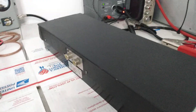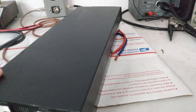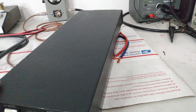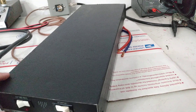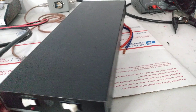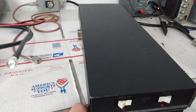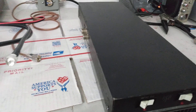I think if somebody was going to repair it, you would just want to take the bias circuit out of it. I think that's going to be detrimental to the HG transistors, the 2290s. I don't know anybody right offhand that has run that many 2290s together. I can't tell you how stable the HG 2290s actually are running that many of them. I feel like the failure was linked to the bias circuit. So possibly if you just put this thing back to class C, it would run better and more stable.